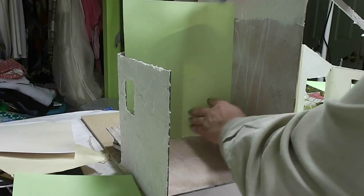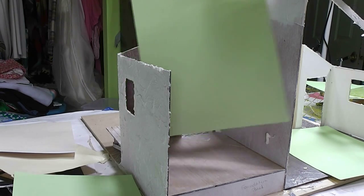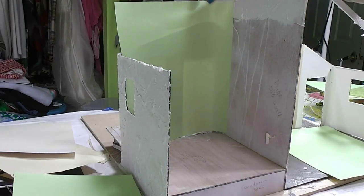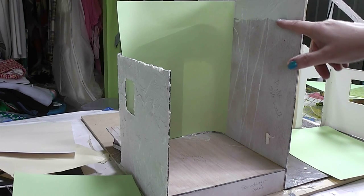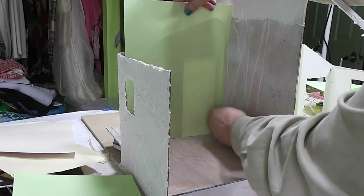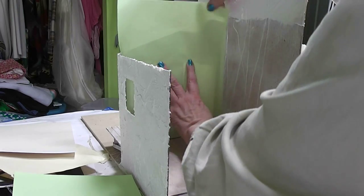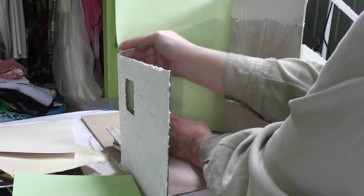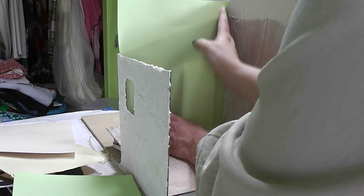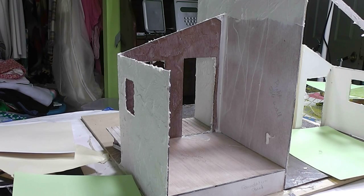I went ahead and cut my pieces. Now I was going to do a pattern for this but I don't really need to — I'll put a link to the pattern video in the blog post. What I cut: this one I left extra to pull with; the side where the ceiling is going to come I cut off because we have wall above it. On this piece I cut it about a half inch wider than my front wall, so that when I put it in it will wrap the corners. By wrapping the corners and then putting these sides over those wrapped edges, we won't have bare wood showing at any point.